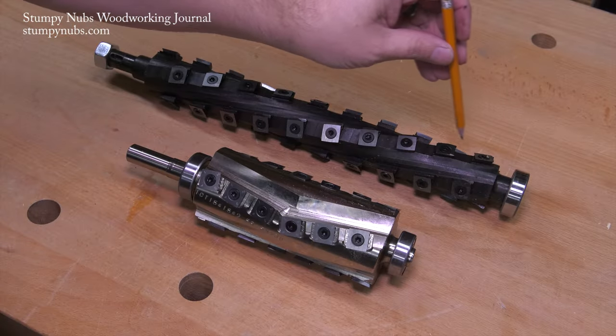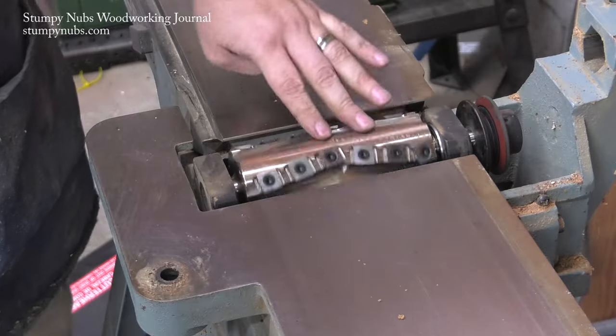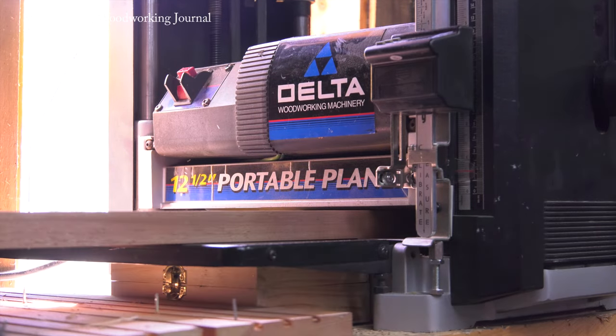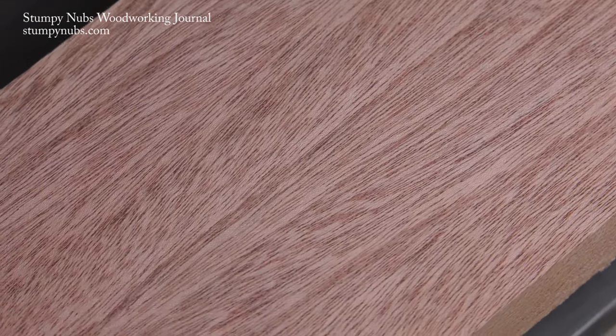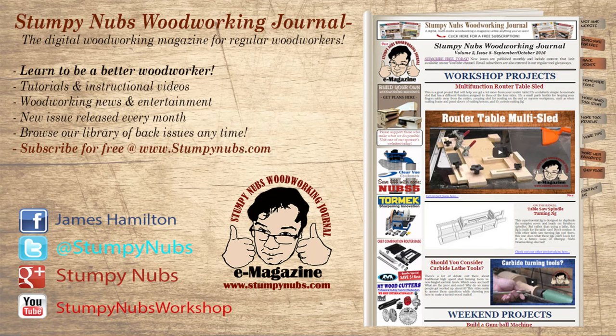I should mention that we originally got a Shelix helical cutter head for the planer and a Titan V-shear head for the jointer. The plan was to compare these two different styles from different manufacturers and see which one worked best. But since then, we've swapped the V-shear head out for another Shelix helical head for the jointer as well. The V-shear heads are still in development, and when the new versions become available, we'll take a look at them. So is a helical head upgrade right for you? If you decide to do it, plan ahead. Byrd, the company that makes the Shelix cutter heads, does them in batches one machine model at a time, so there may be a significant wait time. I recommend going over to mywoodcutters.com, linked in the notes below. If you don't see your machine listed, send them an email — they can most likely get it made for you. Be sure to check out the latest issue of Stumpy Nubs Woodworking Journal for more tips, tricks, and woodworking goodness. You can read and subscribe for free at StumpyNubs.com. Happy helixing!